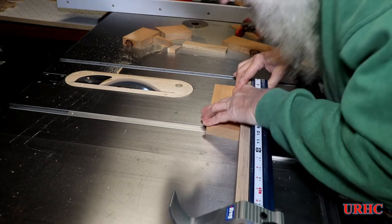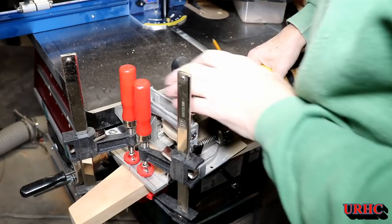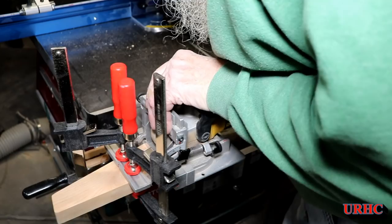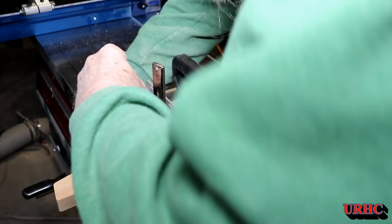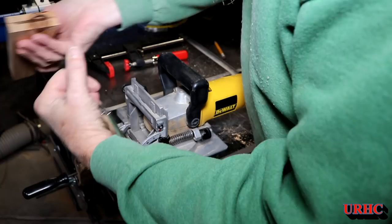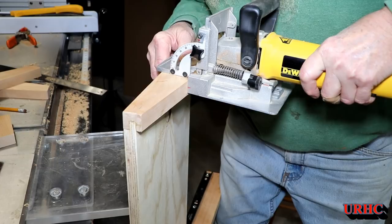While the glue is drying, I went over to cut the little support feet blocks — just two pieces cut off the ends of the other strips. Got a knot in it but it really won't matter when it's put together. Time to put some biscuits to join it together. They were a little narrow for the pins on the biscuit cutter to hold, so I just clamped them to the fence so nothing would move — you want to make sure when you're getting a pocket centered you have it really clamped well. The pockets came out perfectly centered even though they were narrower than the pins. Then putting the mating biscuits into the stool part.